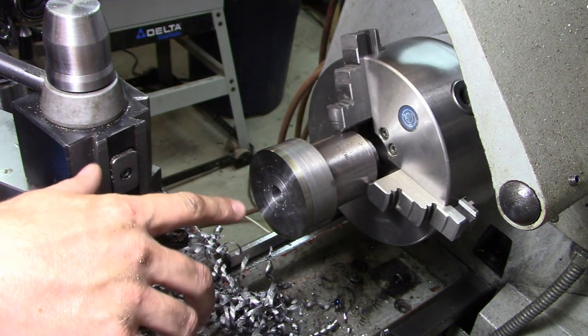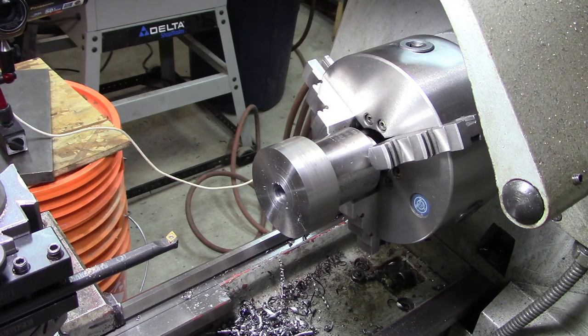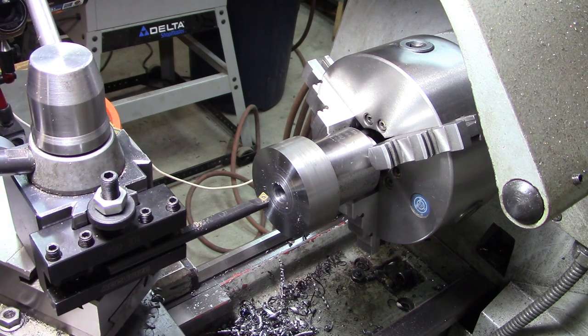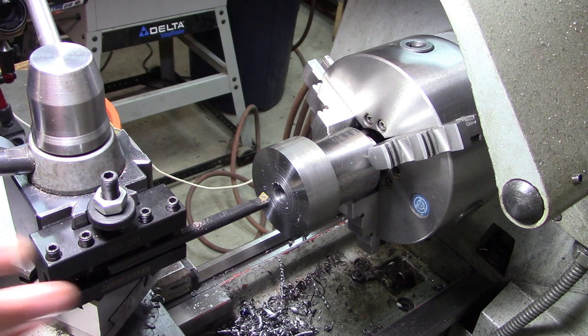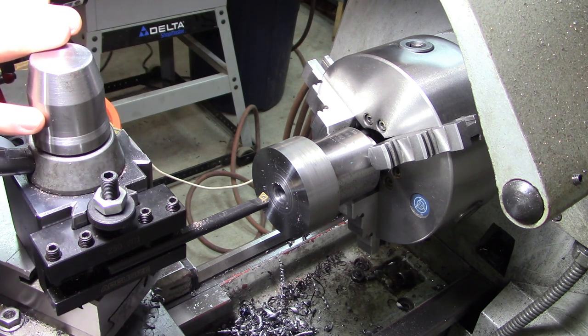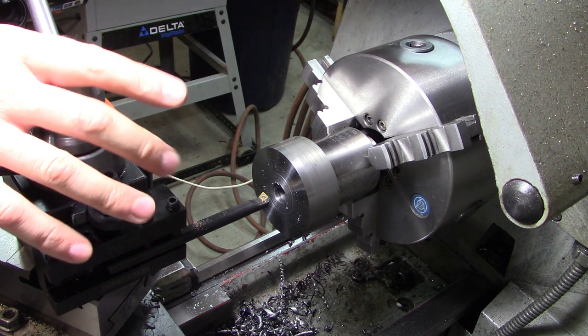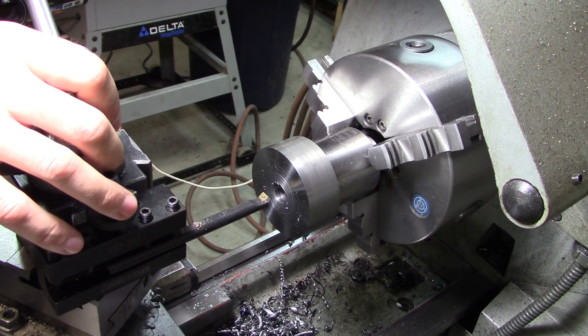The hole we just drilled is actually two and five-eighths deep, so I should be able to go in two and a half inches with the reamer and not worry about bottoming it. I tell you, sometimes it's hard to get time in the shop — this piece has been chucked up here with the hole drilled in it for almost a week. Last time we were at it, the hole was drilled up to 37/64ths — the next biggest drill bit I have before five-eighths. I need a nice clean five-eighths hole to fit on the shaft of the motor, so we're going to do a couple quick boring passes with the boring bar. It's at 577 thou for bore size; I'm going to take 40 thou out of it, and that'll leave another 8 thou or so for the reamer.